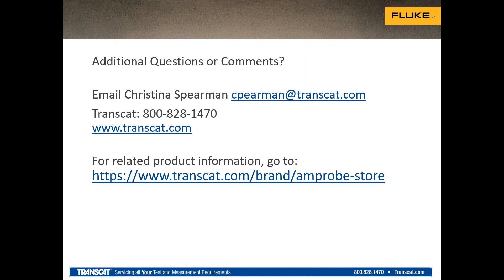Next question: Can the Norma 6000 series be used to capture events like dips and swells? Just to clarify what we've talked about — the Norma doesn't support any kind of event triggering like you would with a power quality analyzer. While you can see live waveform information and even capture and store that data, you can't set up any custom triggering to capture events. That would be limited to our power quality analysis products or our scopes. If you have high-frequency events you want to capture specifically, a Fluke oscilloscope would make more sense because you can set up custom triggering.